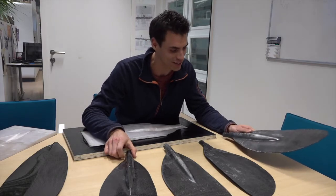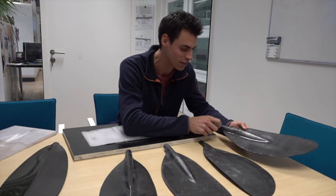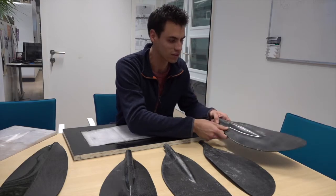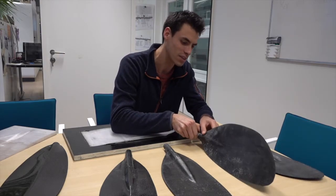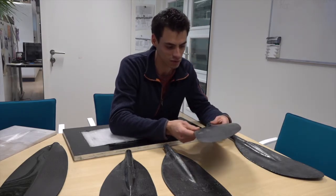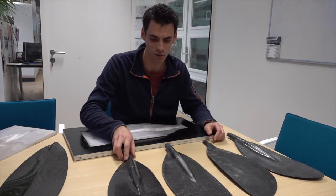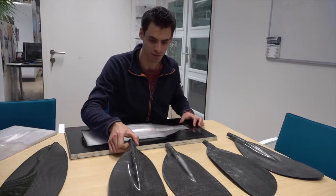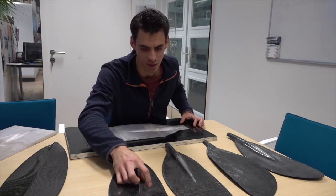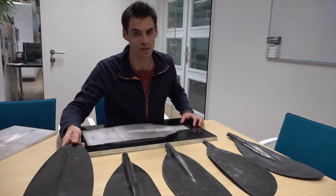It's getting much better over time. You can clearly see that this one, apart from being very heavy, the fibers are not correctly placed in the mold, so you see a lot of resin. This one seems a bit dry, so it's light and the shape is good, but the infusion process didn't quite work on that one. I think the last two are remarkably better, especially this one. You can still see some air trapped inside the product, but it's starting to really look like a proper production mold.